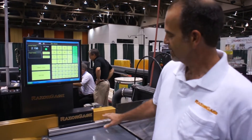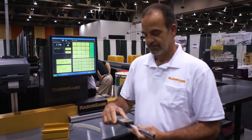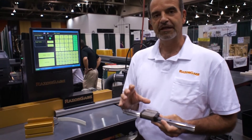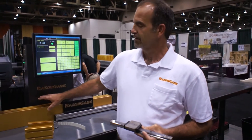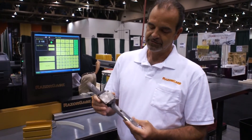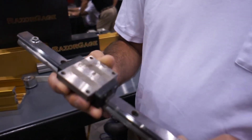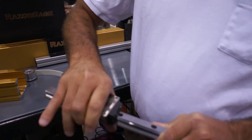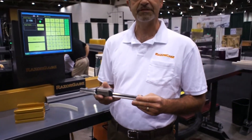Let's start with the stop itself. The stop is mounted to a carriage on which two linear bearings like this are mounted. Our competition uses an extrusion within an extrusion and uses plastic pads to ride on the aluminum inside the beam. Aluminum extrusions are never straight or true, so it makes a poor bearing surface. What we use is a high-end linear bearing — hardened and ground steel rails with recirculating balls inside this block. These have virtually no play in them at all. These are the kind of bearings you'll see on high-end precision CNC routers and machining centers.